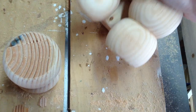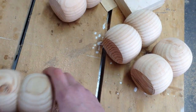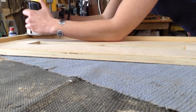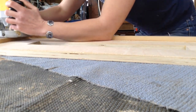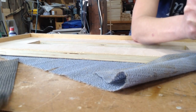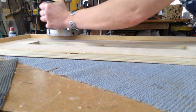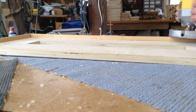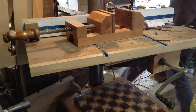Since this is going to be painted, the slight roughness on the outside surface is not a big deal. They all turned out fairly uniform, which was all I could ask for. With the feet done and the base dry, this is the part where I mentioned it would have been easier to rout the molding profile beforehand. You can see I'm kind of teetering on the edge with the router base; it's doable, but there were a couple spots where I may have to patch because the router tipped slightly.